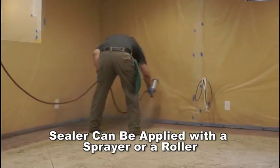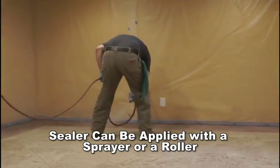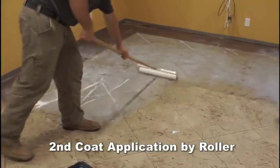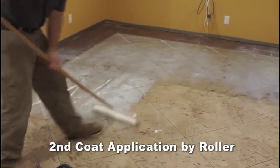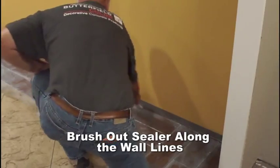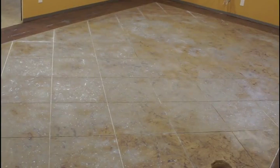Application of ClearGuard Cure and Seal on exterior surfaces and ClearGuard H2O Wet Look Sealer on interior surfaces should be applied by sprayer or roller. Application of a sealer prior to 72 hours may weaken the surface of an overlay. Sealed surfaces may become slippery when wet, and use of a non-slip additive to the sealer is recommended.